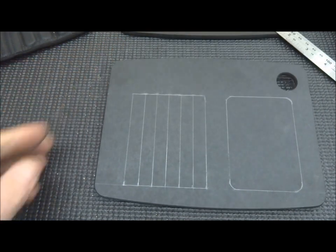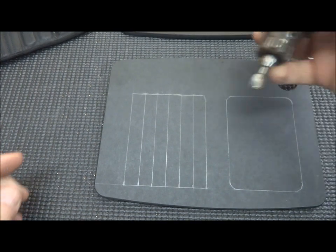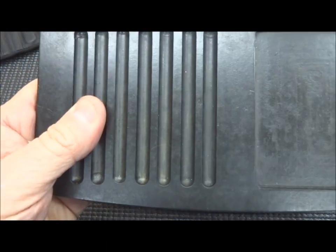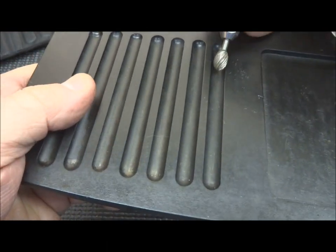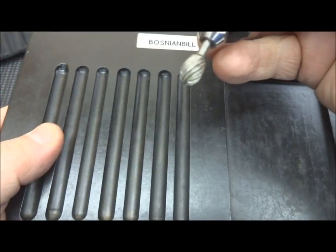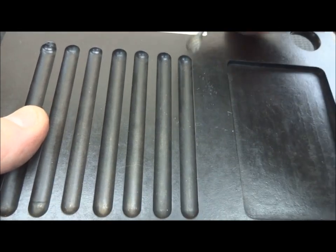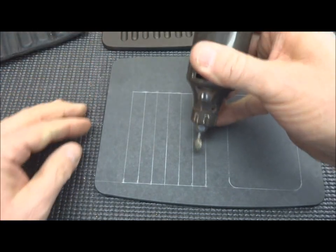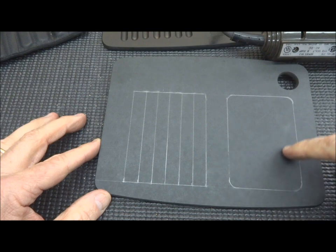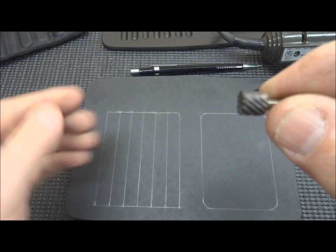These lines represent the center line you're going to be grinding and cutting down. What do you need to do that? You're going to need a Dremel tool, obviously — but what kind of bits? In order to cut these grooves rounded, as on the original, you're going to use a rounded bit. You'll use this rounded Dremel bit to go the entire length, and this rounded bit will also allow you to plunge and leave it rounded on the end so you can easily get your pins in and out. That's what you'll use for the vertical pin-holding lines. Now on this little pocket on the side, we want something squared on the end.